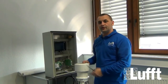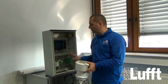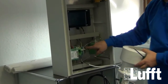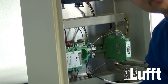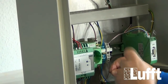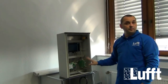I will now show you how to connect the external precipitation sensor to the WS sensor. The connection is also done inside the cabinet using two clamps. The original WS cable uses gray and pink wires on the clamp, and we connect gray to gray and pink to pink from the external sensor. The hardware connection is now complete.